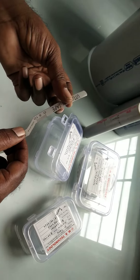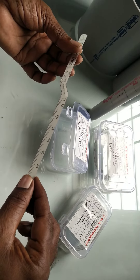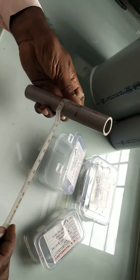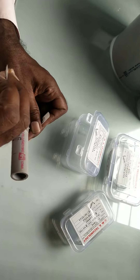To check the diameter, hold the vernier scale in the left hand and the main scale in the right hand. Wrap the pi tape around the pipe like this and apply sufficient pressure.